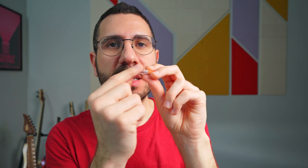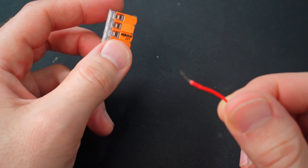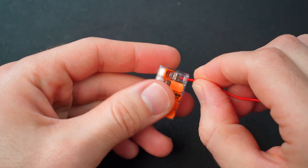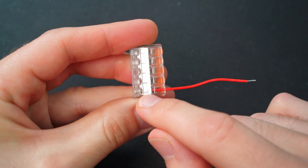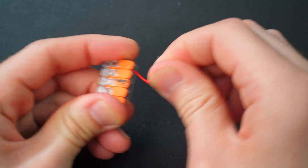The simplest way to explain how this thing works is that all the wires you put into it will create a connection between them all. Let's zoom in and I'll show you how it works. You've got the latch right here — easy to open, easy to close. I've got a stripped wire stripped to the length indicated on the side. Open up the latch, put the stripped wire in, close down the latch. As long as the stripped wire is past the metal contact inside, everything will be conducting. The latch is tight — I'm going to pull on this — it's not coming out.